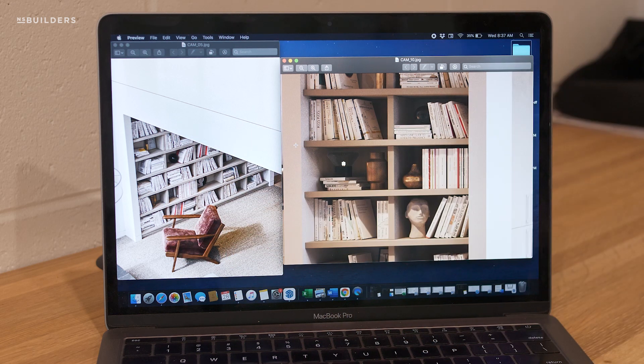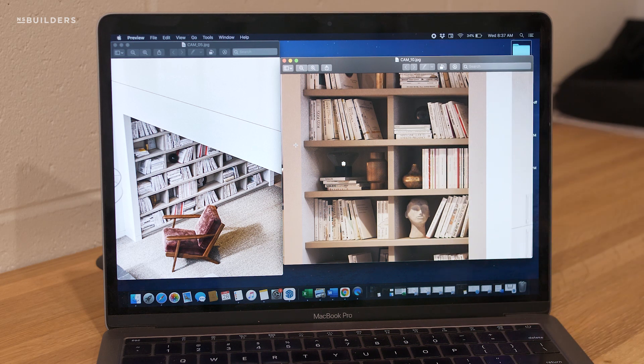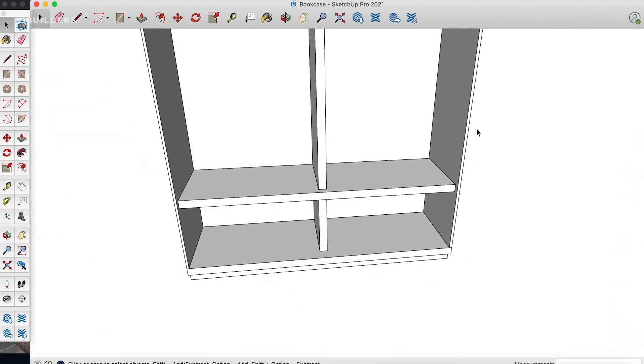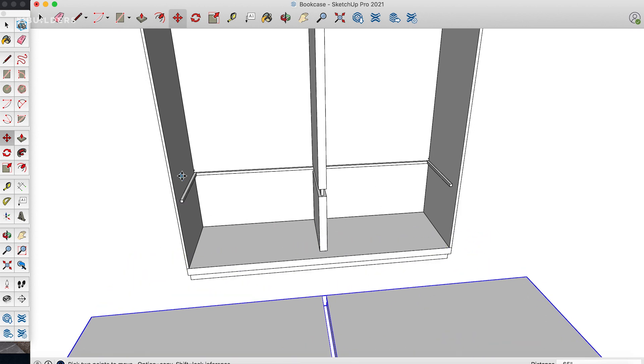You can see in this rendering that the horizontal shelves are sitting proud of the vertical pieces by about one inch. This means we can't just have these shelves floating in there and make them adjustable — we need a full run of that entire length. This is where the joinery starts to get a bit funky. To work through it, I modeled everything in SketchUp to get a better understanding of how these pieces are going to look when completed. This is the smaller bookcase and I only modeled up one shelf since the joinery is the same throughout.